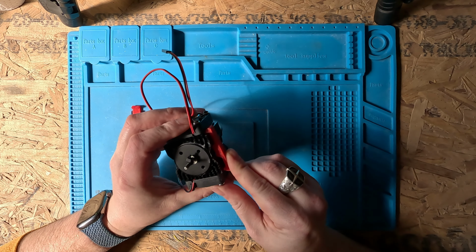Once again, I didn't start the test quite at ambient temperature, so I've had to extrapolate a few figures, but we can clearly see this is the winner. In contrast to the other tests, the temperature rise actually levels off, so I'm confident I could run the motor for a long time like this.